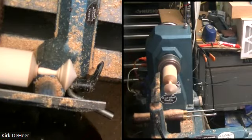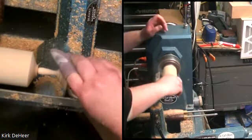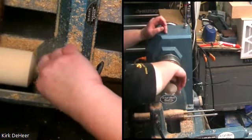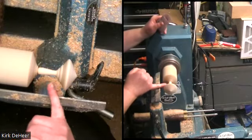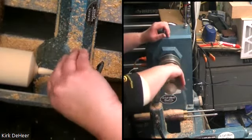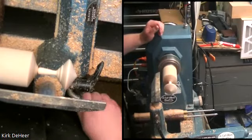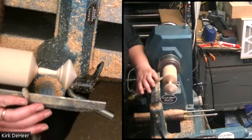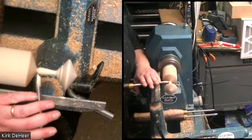This is against the rules — never cut uphill — but that's exactly the way you do it with a top. Reach around, clean up that little spindle right there. You can see we've got some steps here, just a little bit of detail to give the top some interest. These are so much fun — kids love these. When I sell tops I always say you have to buy them in pairs. We're just going to part this off with our spindle gouge, and it's really that easy.